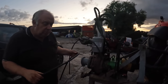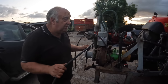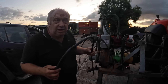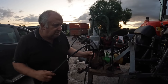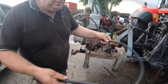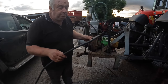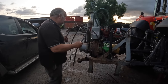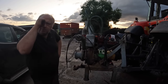So it wasn't even the problem we thought it was - it's a different problem altogether. Nothing to do with the coolers. This pipe is connected to the load sensing and to the front suspension. The way the plumbing is done on the tractor, it's all connected together. When I left it for a little while with everything dried off, it was dripping - actually dripping out of it. The amount of oil that was coming out - to get the pipe out we had to cut it because it was jammed under the tractor. We put a new pipe in and re-routed it down the left-hand side of the gearbox rather than the right-hand side so it can't get caught where it got caught before.